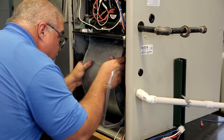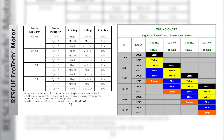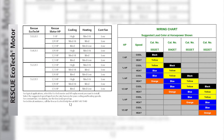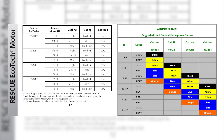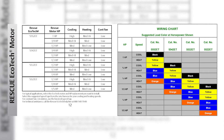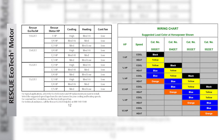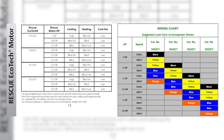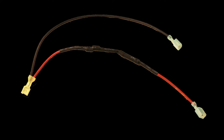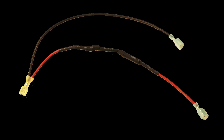Install the blower housing back into the HVAC equipment. Using the chart on page 11 or the outside of the Ecotech box, find the horsepower of the PSC motor you are replacing and the Ecotech model number you are using. Where these intersect, you will find which leads to use for heat and cool operation. Connect the colored leads to the control board. The red lead on the harness will always be your continuous or constant fan speed. Not all manufacturers provide a fan or continuous fan pin on the control board; in this case, you will use the Y harness adapter provided.